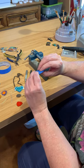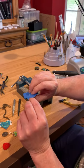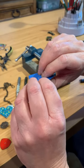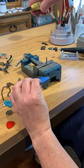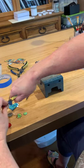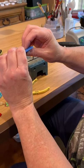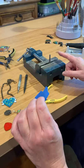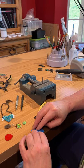Once the wire is pushed all the way up, I want to cut it to less than half. One millimeter is a good size. I snip with the flat side of my snippers, put my finger over it so it doesn't hop away. It looks really short, but this is actually the perfect height. I'll leave that here gently so it doesn't fall out.